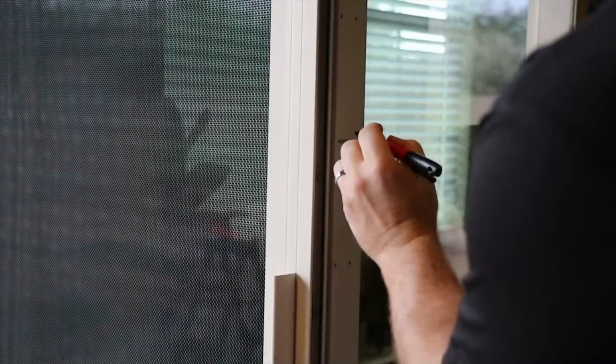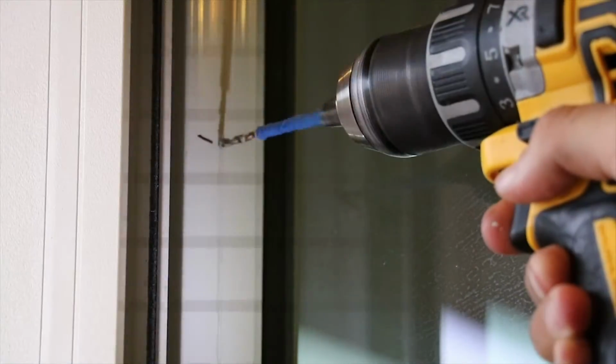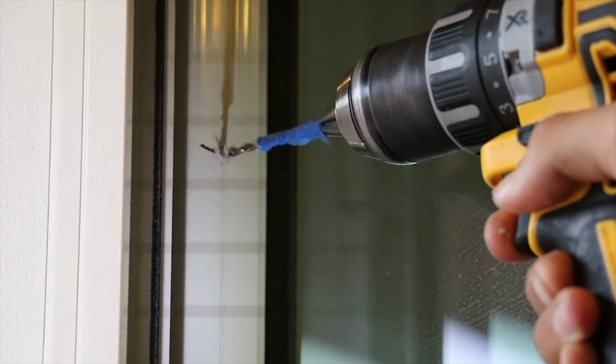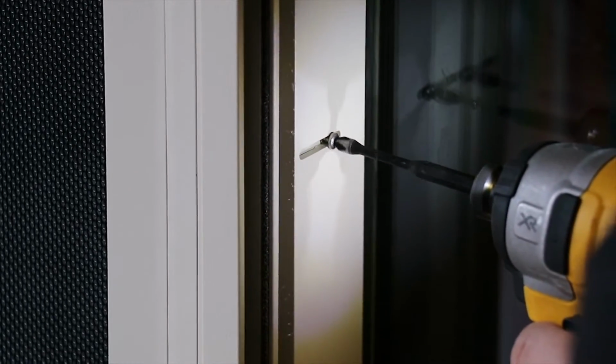Using a 1/8" drill bit, drill at least 5 mounting holes in the main patio door inactive panel through the oval mounting holes and 2 through the small mounting holes, being extremely careful not to drill any deeper than the tape mark on the drill. Install the interlock mounting screws to the oval mounting holes, leaving them slightly loose.